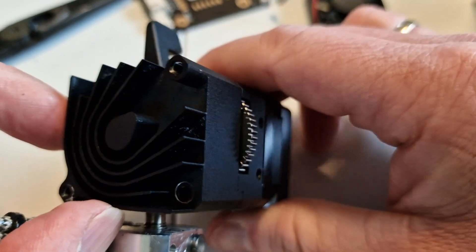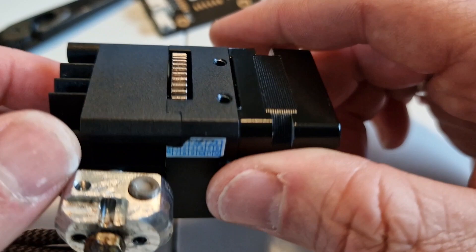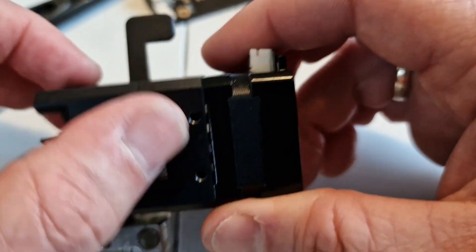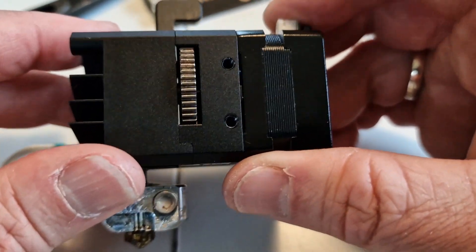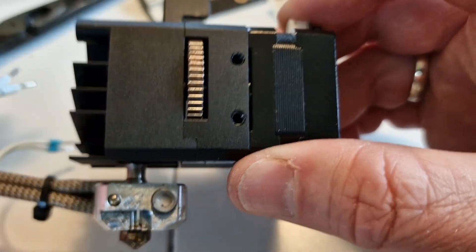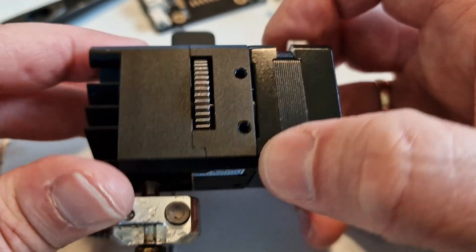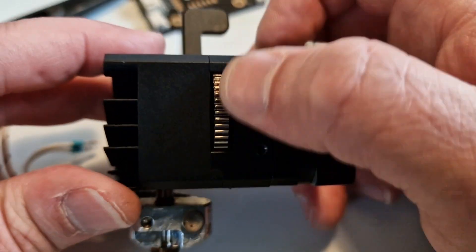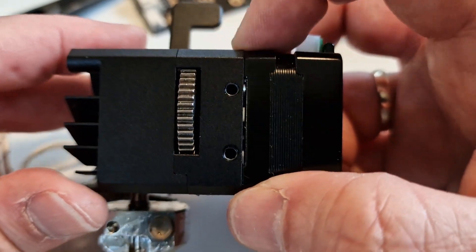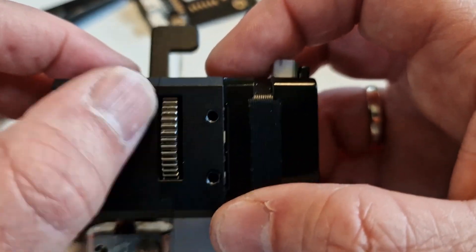I wanted to share that with everybody. Anybody being plagued with that clicky gear backlash going on with your H2 — if you've shelved it, hopefully you still have it and can give it some new life. Just put some Kapton tape around the bearings, or any other way to secure those bearings in there. I don't know how long it's going to last, and hopefully the Kapton tape doesn't work its way out and jam gears anywhere else. I'm going to contact BQ with this video and show them too.